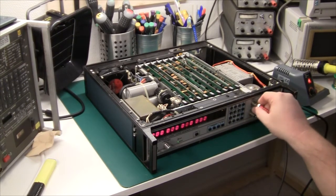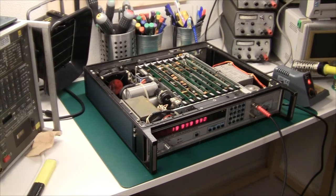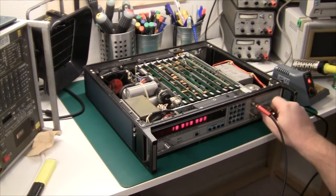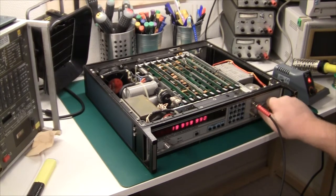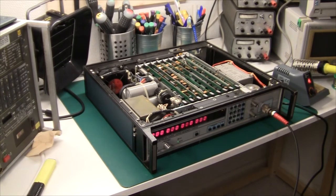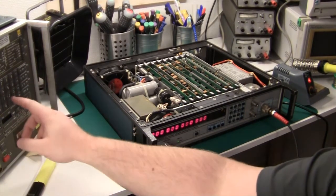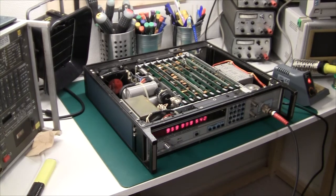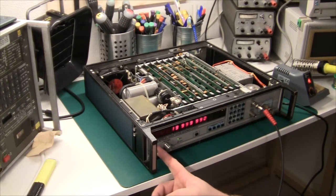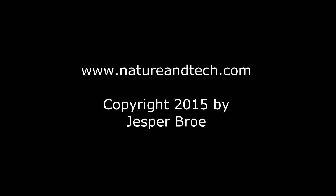Band 1 — yes, beautiful. And finally, let's try band 3: it says 1 GHz to 18 GHz. My signal generator cannot generate 1 GHz, but if we're lucky we can try 960 MHz — and yes, 960. So band 3 is working fine. My frequency counter has been repaired. Just do it step by step, follow the signal through the circuit, and eventually you will find the problem. Thanks for watching. Bye.